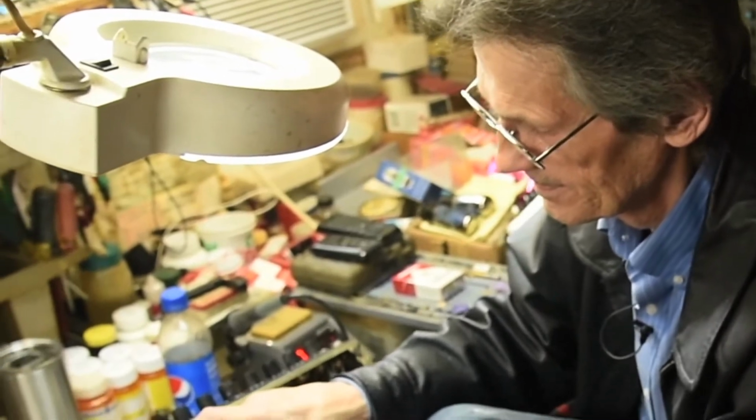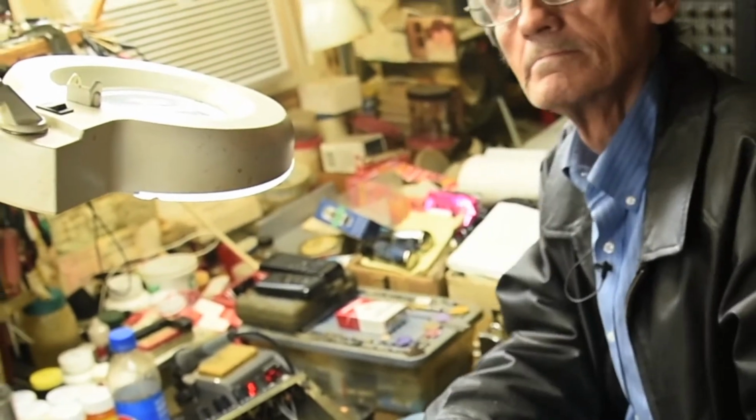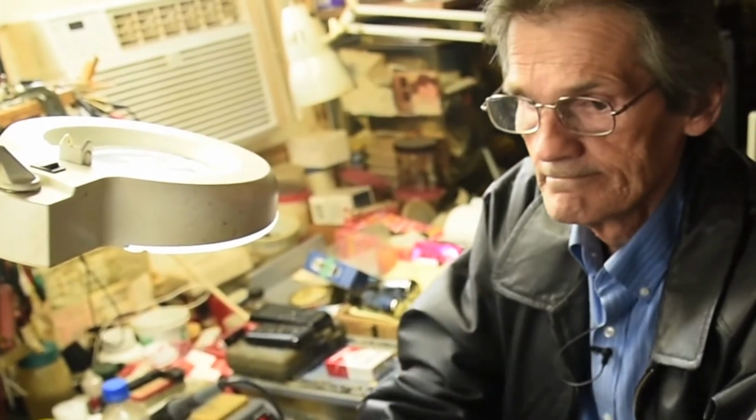Tuck, can you give us a real quick lesson on why the step up to 450 volts? What's the result if you try to accomplish the same thing with 110 volts? All the tubes won't even run. Is it because it's not possible to make a tube that could get the job done at 110, or would it be too noisy? Well, they didn't have the technology when these tubes were developed. The 6L6 was made back in about the 40s, I'd say. And as far as I know, we can't get it any lower. I may be wrong, but all output tubes still require high voltage.